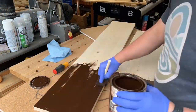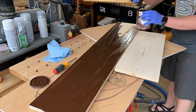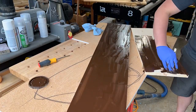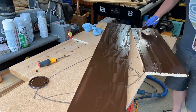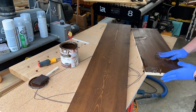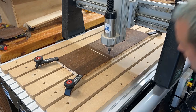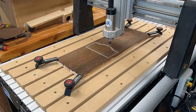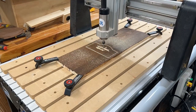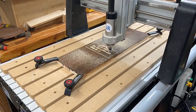When it comes to batching out projects, you want to pick something inexpensive. Pine — just a standard board from your local home center — with stain is a great method. You could do plywood, MDF, or other options, but just some basic stain on a basic pine board from Home Depot can really give you great results. With quick application and a preconditioner, you get great contrast between the natural color of the wood and the stain, making a great finished project. If your goal is to mass produce, this is a great efficient method.